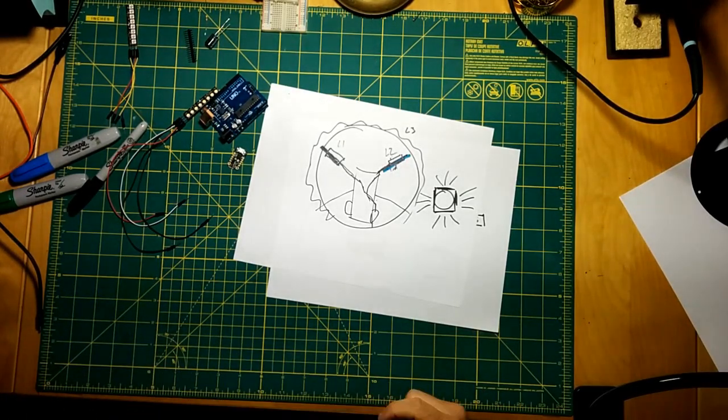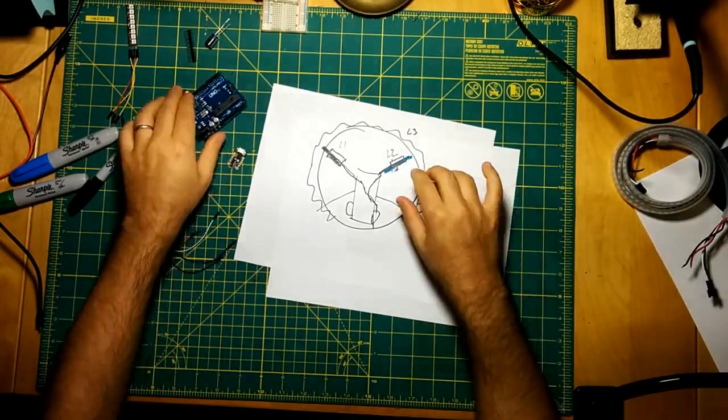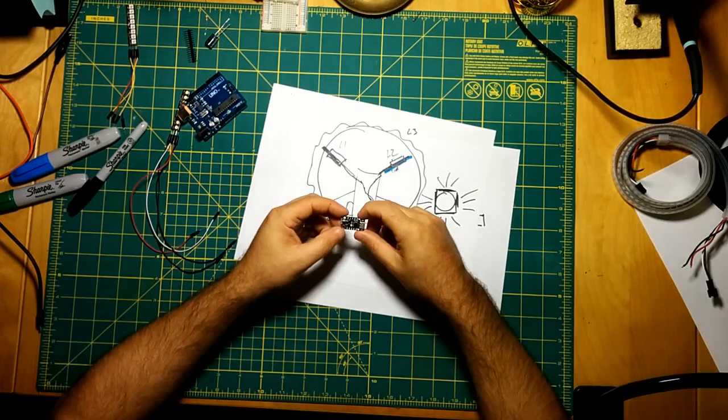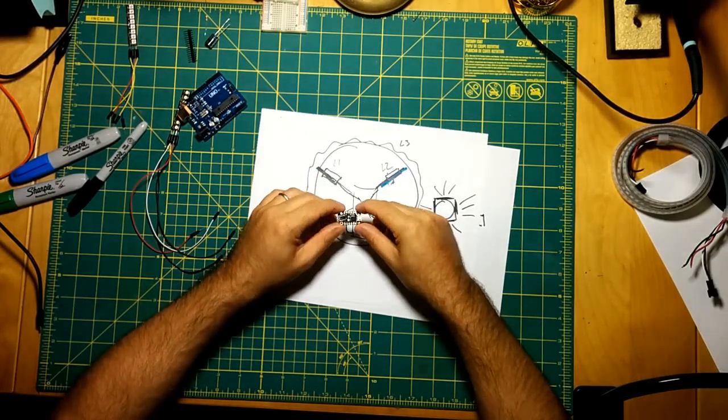And I think probably four output pins would make sense. Again, because you wanted to keep the board compact. And then this Trinket here, we're going to need a couple of pins for the screen, some for the buttons. I honestly don't even know if we're going to have enough pins on this board. We may have to use a larger one.